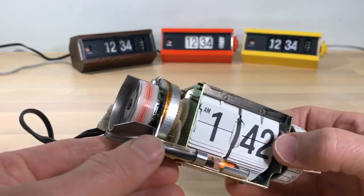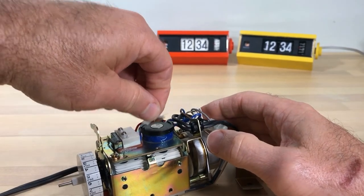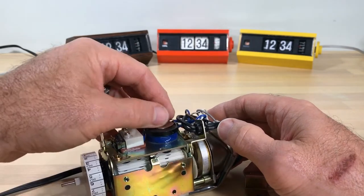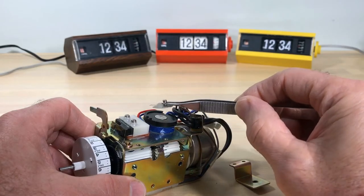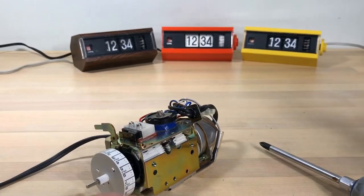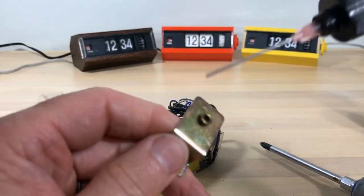Let's turn our attention back to the mechanism to get this alarm working — why, I don't know, they're awful terrible alarms, but we're going to get it working. I've taken the back plate off the alarm to look at how it's constructed — it's very simple. This little metal plate with small spring arms is going to vibrate against the metal bell. At first I thought maybe the arms needed to be re-bent, so I played with that a little. I've taken the spring off — there's a spring between the metal plate and this little piece. Let's see how it wants to bounce. I'm going to take a toothpick and try to clean that out. At this point I started thinking: what if it just needs a drop of oil right there? If you ever have one of these problems, try that first — just put a drop of oil without taking anything apart. I'm suspecting that might actually fix the alarm, though I have no way of proving that.